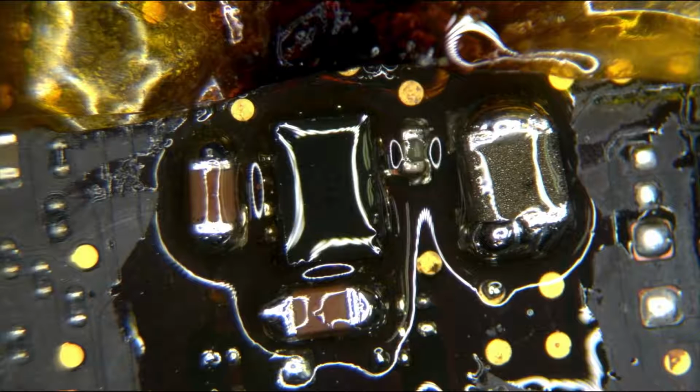That's a nasty junk left over on that pad. Let's get rid of it all. There was some little junk left on it when I started working. That was a piece of whatever resistor I removed. Now the short is gone, those two resistors shouldn't burn again.